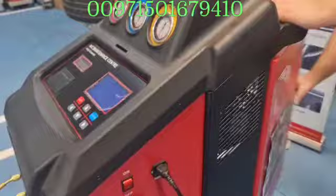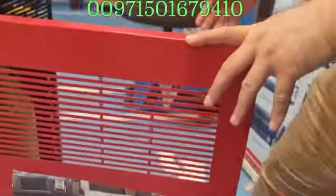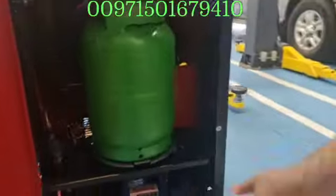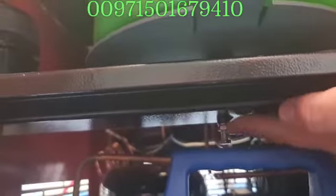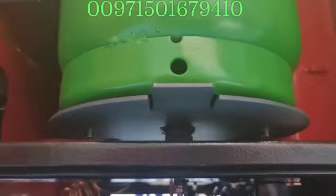Please remove this screw just to make the scale free — because this machine has got the filling protection, as we said, and also this screw. This screw has to be removed just to make this scale very free so it will do its work.